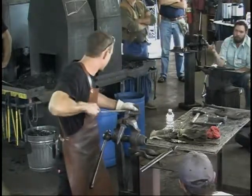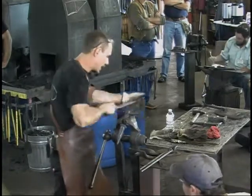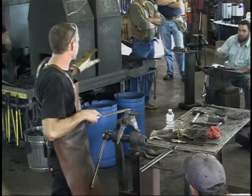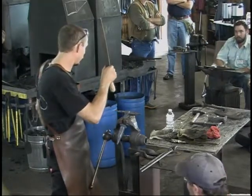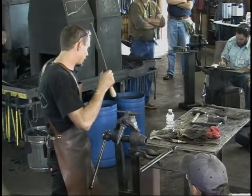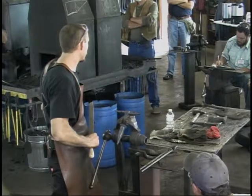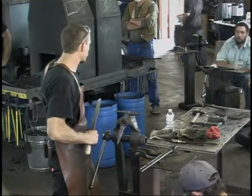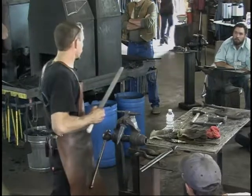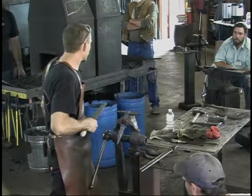You're doing all of that before you heat treat? Right. I'm taking 36 grit and filing. But I'm doing like 90% of the finish work prior to heat treatment. And then ideally you're taking a very small amount of time to get it up to temperature and quench it, temper it, and then you can do your final sanding.